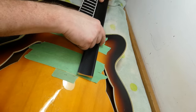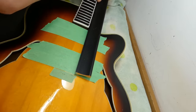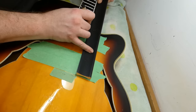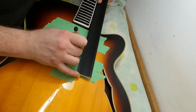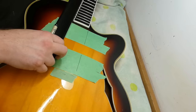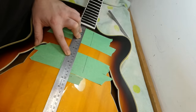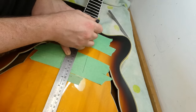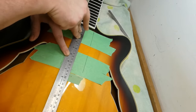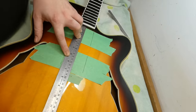In this case, this neck is reasonably straight, though there's a bit of a bumpy thing around the body joint. It's hard on an archtop because of the undulating quality of the guitar, but this should give us something to work from. And it seems like the center lines are slightly off — it actually moves. It's pretty close at the end of the body, but up here it's almost 3/32 of an inch — about 2.3 millimeters — from where I'd expect it to be.